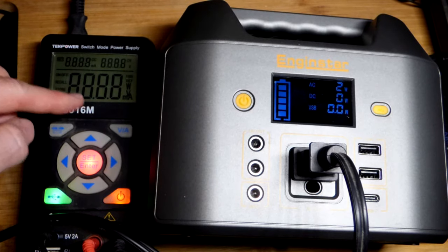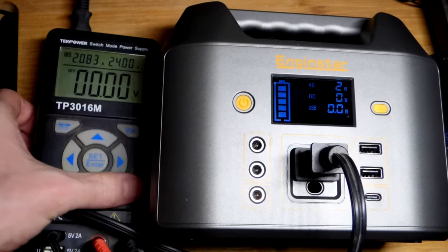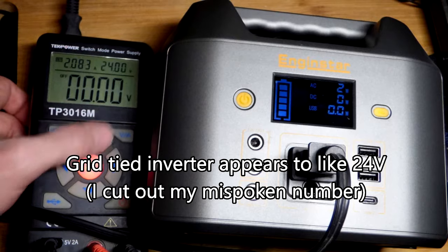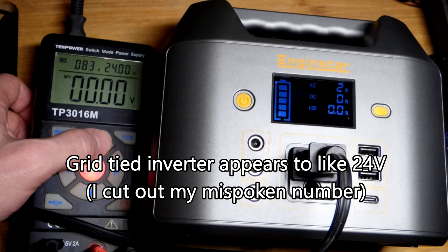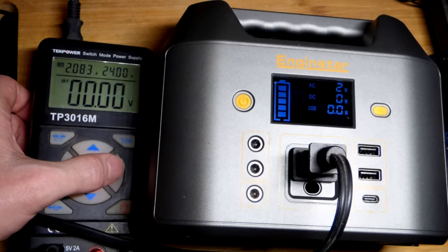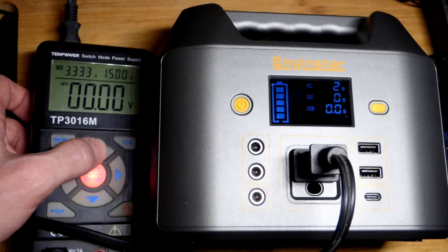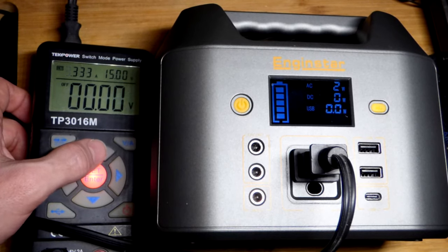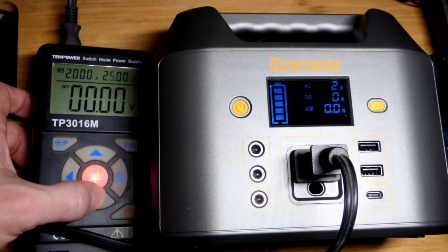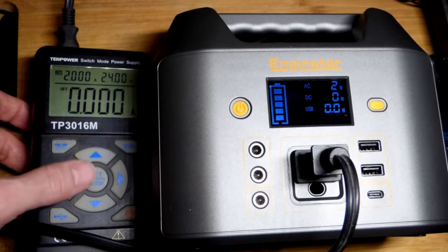So that's for this power supply there, and so there it turned on, and so yeah, we got the current up there. So that's at 24 volts. I believe the unit I'm using, I could be wrong, but that's the max current I can get out of this power supply there. So we got like 48 watts of total power we can provide at this point. I think we can get higher though if I go to 15 volts. I'm not powering anything, so I don't have to be terribly careful. Okay, yeah, it's still in the range of like 45. So I think we'll just go to a 24 and stick with that. I'm not going to test the minimum that we can do. 24 volts, 2 amps. We're pretty good right there.